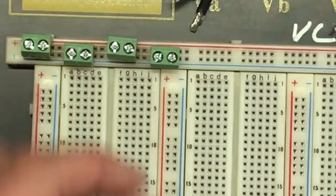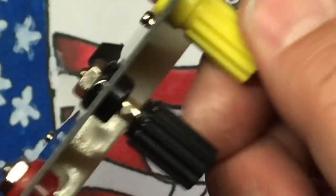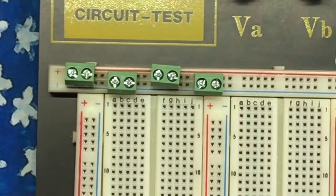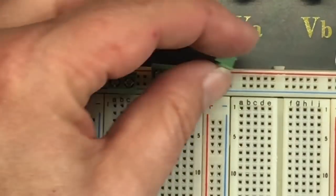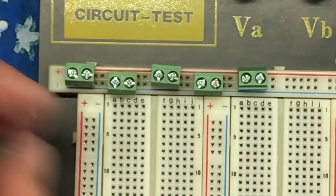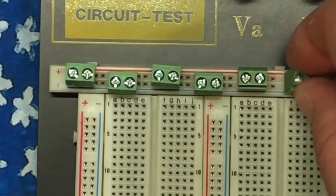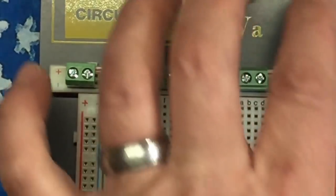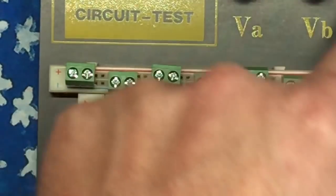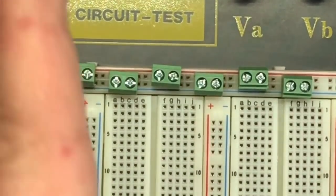Okay. But what we're going to do is take these banana plug terminals here and wire in our XT30 and XT60 into there. And then we're also going to bridge a couple of those wires, positive and negative, going this way. That one's positive, sorry. And negative going this way. So we're going to have positive, negative, and that's going to power the board. And these are going to be our outputs to what we want. This will all come together in a minute.